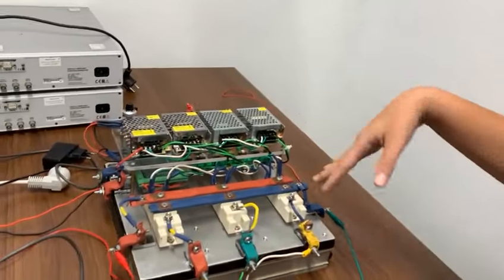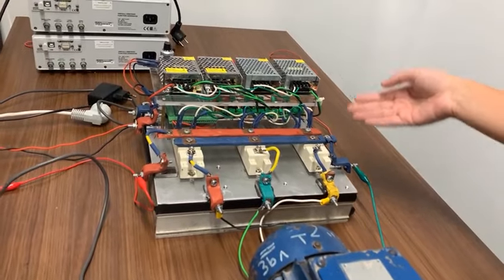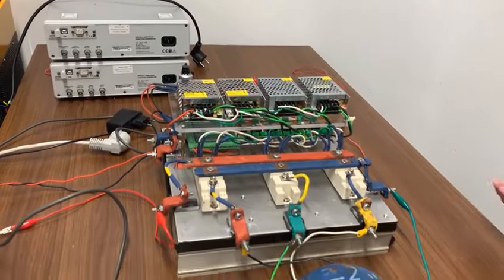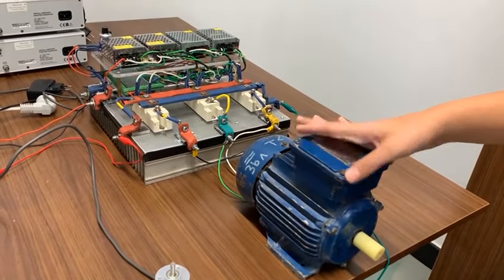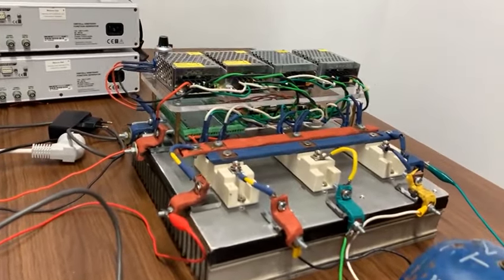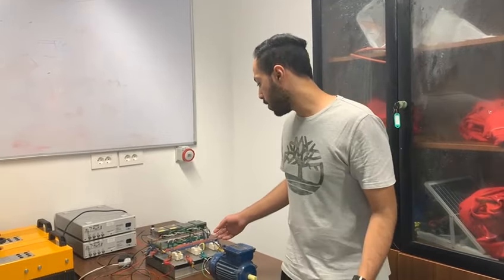This is the connection we have here. This is our IGBT and SMPS for our gate drive, and this is a smaller motor we are using for testing. This is the bus bar for our connection. This is the potentiometer for control. We are using the Semikron IGBT module as it is widely used in power electronics.